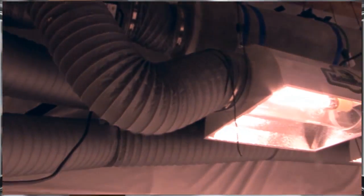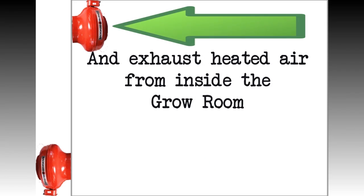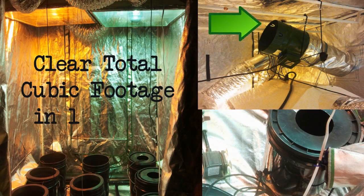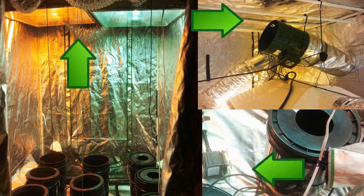Air cooling is a term used in contrast to air conditioning and basically means using a fan. This method uses fans to pull cold air from outside and exhaust the heated air generated inside of your grow room to the outside world. The goal, like all of indoor growing, is to mimic perfect outdoor conditions. The target is to clear the entire cubic footage of air in your grow room in one to two minutes — the faster you can exhaust all the air the better. The idea is to replace the heated air from within your grow room with much colder air from outside.